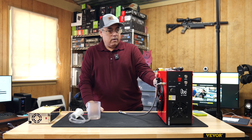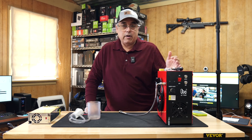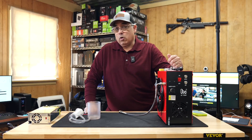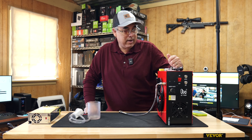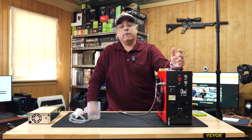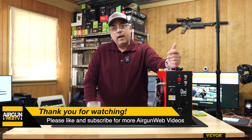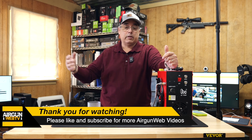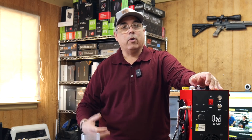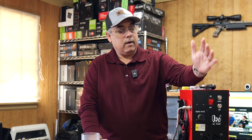Let's talk a little bit about why I'm doing this today. A lot of the little portable compressors are oilless, waterless, just air cooled. But this one, because it's designed to run continuously for up to five hours, it's actually got a water reservoir, a radiator, and all kinds of stuff like that. We had some really cold weather, and rather than just leave this out in the shop — my shop isn't climate controlled unless I'm down there to run the wood stove — I don't want stuff to freeze. We had an issue in the past where we serviced a bunch of compressors for a compressor company, got them all up and working, and then we had a really bad cold snap. We had drained them but did not blow all the water out, so there was water in the radiators, blew all the radiators, and we lost about $3,000 worth of inventory due to freezing. Don't want to do that again, and certainly don't want to do that to this compressor.